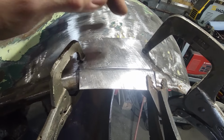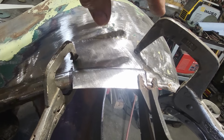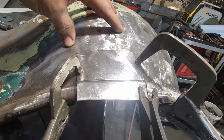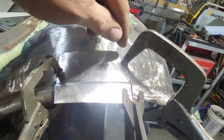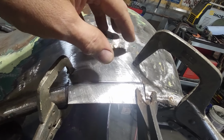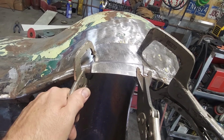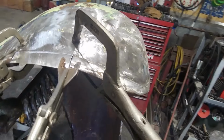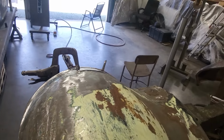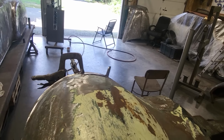Now, one of the advantages of doing the lap like this when it comes to a panel like this, okay, this process will work out great. Now, if you turned around and took this here and did a cut to fit butt joint, the one thing you're going to notice is that the door is going to move. The whole panel is going to move on you. And what you're after is to get this to flow nice this way. Okay? That's got a nice flow going along that door now. That's what you're after.